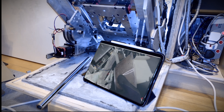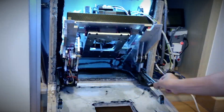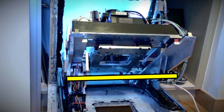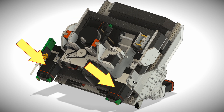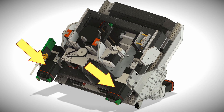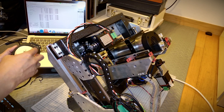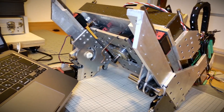That's right. Basically, I'm planning to use the same method this time, but it's even more complex than when we built the saddle. The aluminum frame of the column is split into two parts, and since the A-axis is supported by these left and right aluminum frames, it must be secured firmly after adjustment. To achieve this, I need to control the stepper motors on both sides with Linux CNC, enabling independent homing for each side. Since the left and right aluminum frames are independent right now, if the stepper motors aren't powered, their positions can shift easily. But if they can home independently, they can be restored right away, and we can consider the left and right aluminum frames as a single unit.